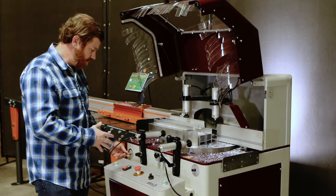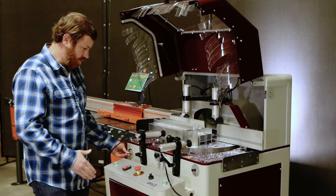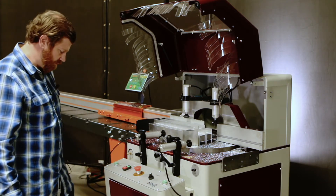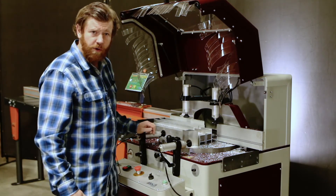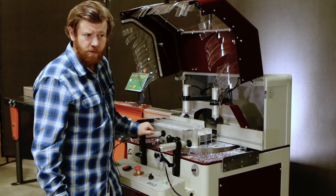To slow that stroke down, simply turn this knob and that will change the actuator speed. We are running the lubricant right now — anytime you're cutting aluminum I would highly suggest that you run the lubricant.